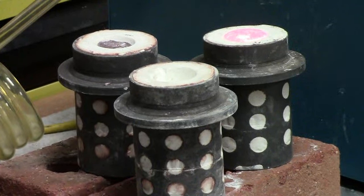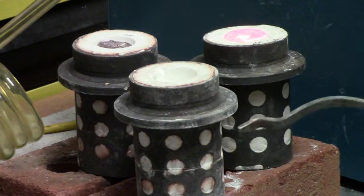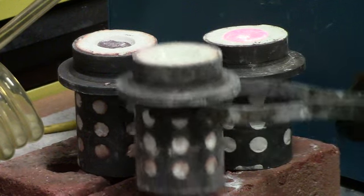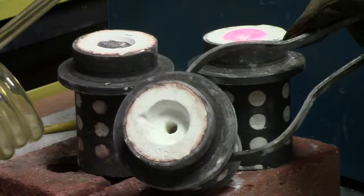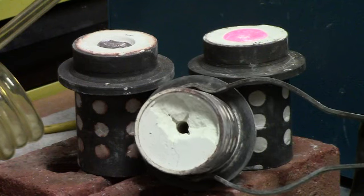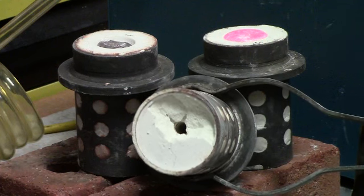Okay guys, as I said earlier, this was a live demonstration, so as with anything live, things go wrong. One of the rules in investment casting, when you put your parts inside the flask, is that you have to maintain a minimum separation between the top of the flask and the top of your waxes. What happened is I exceeded that and I did not get away with it. When I placed this flask in the vacuum chamber and turned on the vacuum, I heard a pop and I knew something was wrong. My parts had been placed too close to the top of the flask and there was not enough investment in the flask to withstand the vacuum pressure, and the vacuum pulled out and separated some of the investment and it broke away.